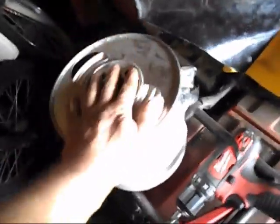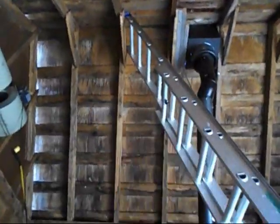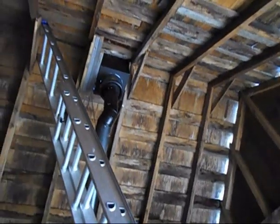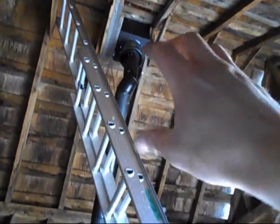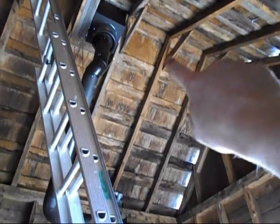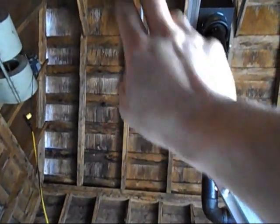I've had this big fat roll of wire now for a few months waiting for this job. Got a bunch of electrical boxes, some heavy duty ceiling fan boxes. I finally decided I'm going to put two industrial ceiling fans in here. I was just going to put regular ones, but it's probably going to get pretty hot up at the ceiling and the blades would just get dried out and warped. Might as well have metal ceiling fans — plus if the blades get close to the chimney, it's no big deal since you have to keep combustible materials 18 inches away. I'll have them lined up right with that roof joist.